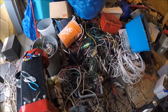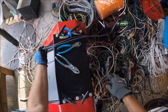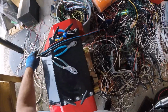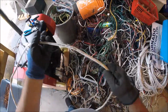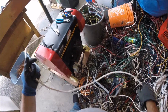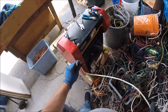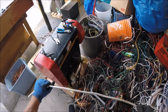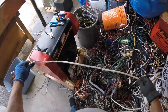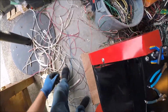Let me get another set of wire here, something different, and I'll get back to you. Some 12 gauge here. This is 12 gauge used with metal conduits, like in apartment buildings or high rises. I also have to let you know, if you leave this wire too long, it takes too long to fiddle. Ideal length is about 2 feet on this twisted stuff, because when you're unraveling it, trying to get the other wires out, it just tangles up and knots up. So 2 foot lengths are easier to play with. That's my guess, right?